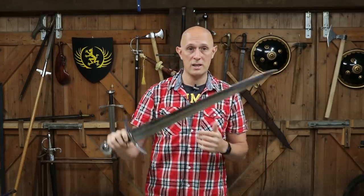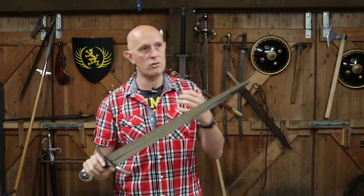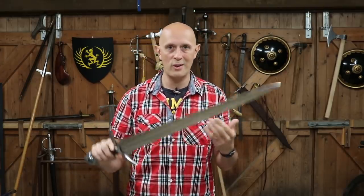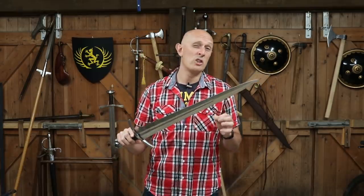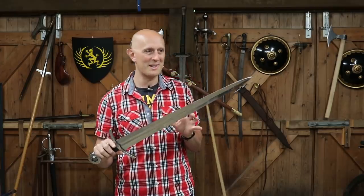And this would equally be historically accurate for these kinds of swords. And it is a very strong edge, a very reinforced edge. It's stronger than the direct bevel. It's stronger than the hollow grinding. That will also reduce a little bit of mass, although it's such a small amount of mass, I'm not sure that you would notice a difference.